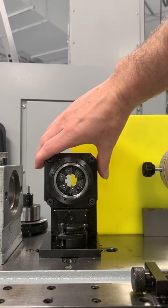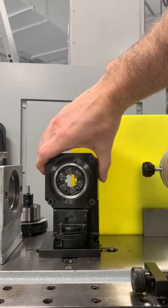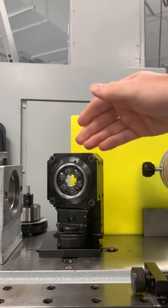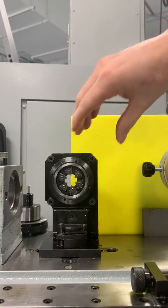You can see when I rotate the whirler, that center line stays the exact same no matter what angle it is. So let's say you run some 4.5mm screws and have a really high angle, then you want to run some 7.5mm ones — you have to change the angle, but you never have to change the center line. So it's really handy.